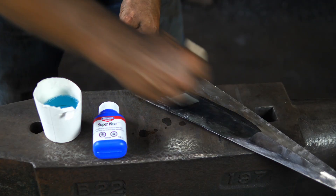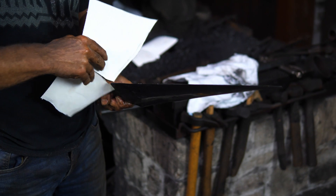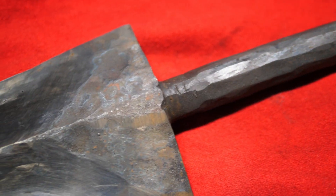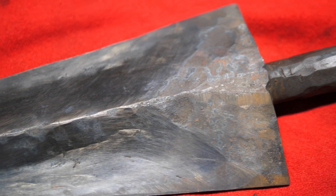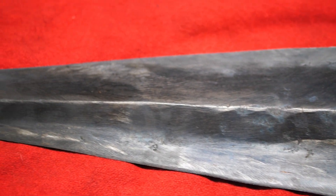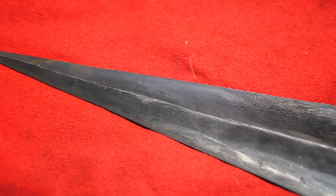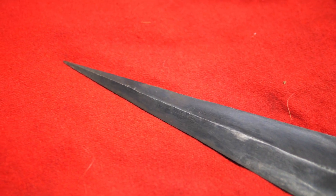I squared it off to create that shape, sharpened it up, and got onto the knife grinder to shape the profile and get that nice straight triangular section. Once I had that, I started grinding the bevels to bring it to more of a cutting edge, then used the angle grinder to form the contours and have everything blend into itself nicely, with a little final fine tuning on the forge. Then I gun blued the whole thing and quenched it — it had a cutting edge and was able to slice cardboard quite nicely. It's a little unwieldy at about 10 pounds for something so short, but it did cut and has a real dynamic appeal.